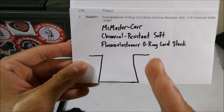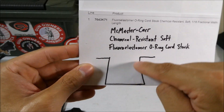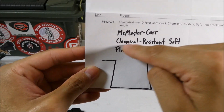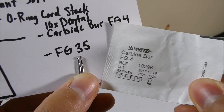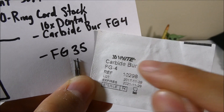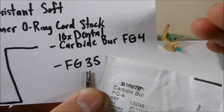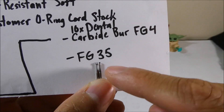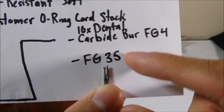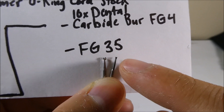As you can see, the walls converge going up, and that helps keep the gasket inside of there, so just a little bit of the gasket is showing. To cut the channel, I used some old dental burrs that I have from dental school — specifically that brand. But you can find these in 10-packs on eBay for about $11 or $12. The ones I used are the friction grip 4, which is the ball-shaped one, and then the friction grip 35, which is an inverted cone.